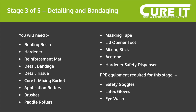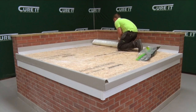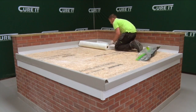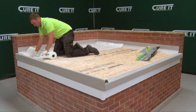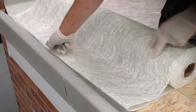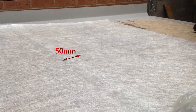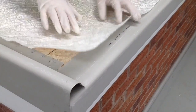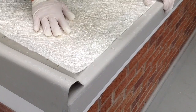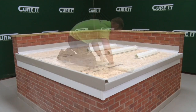Ensure the weather is set to be dry before starting this stage. The first part of stage 3 is preparation of the bandage and reinforcement mat. Roll out the matting across the entire roof. Note that the mat has a straight edge and a feathered edge. Cut the mat to size using a Stanley knife and roll out the next row of mat with the feathered edge overlapping the straight edge of the first piece by 50 millimeters. When cutting the edge pieces of mat, keep the mat away from the face of the edge trim to prevent the finished laminate from overhanging the front of the trim. When all rows of mat have been measured and cut, re-roll each length and keep them in order on the roof for use later.